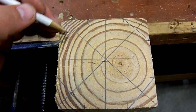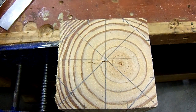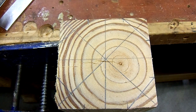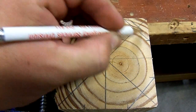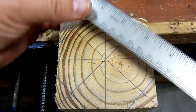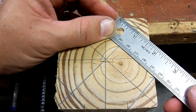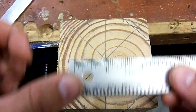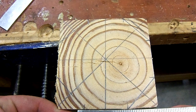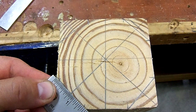I know it's kind of hard to see with the wood grain, but you can see the shape of the octagon. From here, you would take that to your table saw, drop your blade down to 45 degrees, and bump the fence over enough to get the cuts you need, keeping your blade on the outside of the lines. Just to double check and make sure everything is working properly, we're going to measure it. Got right about one and a half inches here. Check the top — about an inch and a half. Bottom — about an inch and a half. Over here — inch and a half.